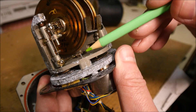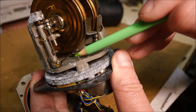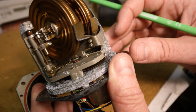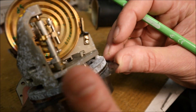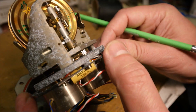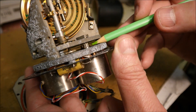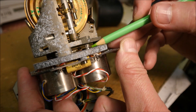We can see here the link between the aneroid capsules and the shaft in the middle, using this gear. It is the same for the other capsule. And here in the middle, we can see the gear train which permits a ratio of approximately 19 between the two synchroses.